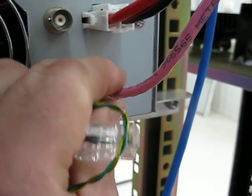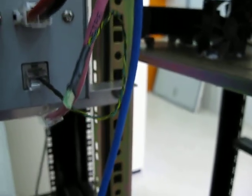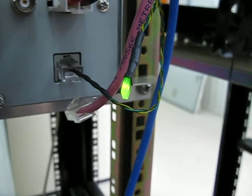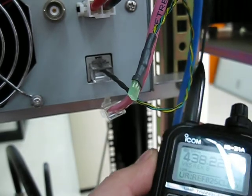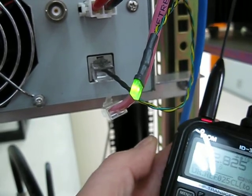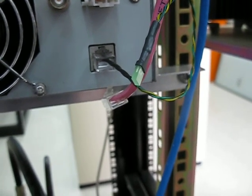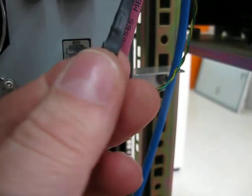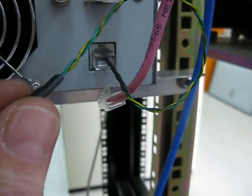I can remove the existing cable that goes to my controller, plug this in, and when I key up on my radio — I've got the ID31 here — you'll see that the LED lights up. As I transmit, you can see it's lighting up. Now if my repeater was exhibiting the same symptoms as in my previous video, this would be flashing and flickering like the LED board. And it's very, very simple to make.